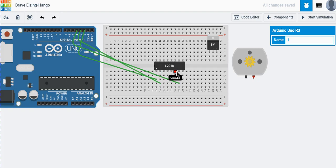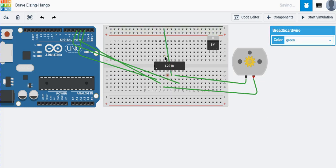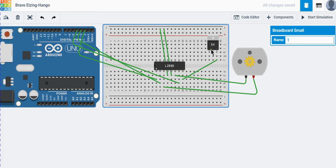Output 1 and Output 2 connect to the motor — Output 1 goes to the positive terminal of the motor. Output 2 connects to the other terminal. There are also two ground pins on the IC, and both connect to the negative rail on the breadboard.